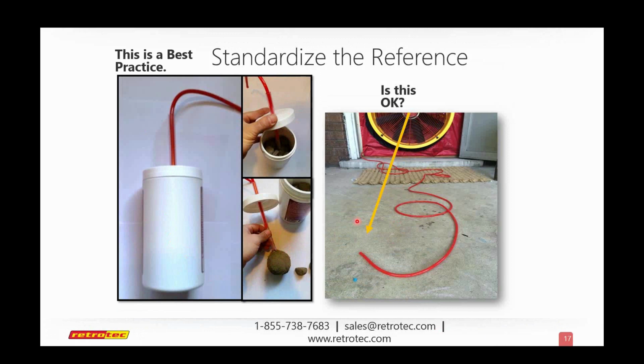One of the problems that you run into when you test over a wide range is that it almost forces you to change flow ranges. And when you take the time to change flow ranges, testing conditions can change, and that will cause a notch in your results. Whenever you change ranges, there's always a little bit of difference. You can run one range into another, and when you do that, you always throw the results off. So it looks like there's an advantage in testing over a wide range.